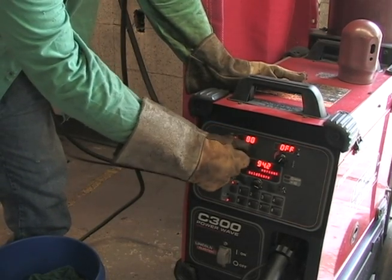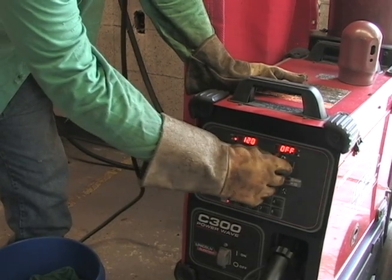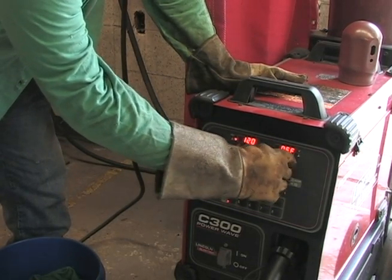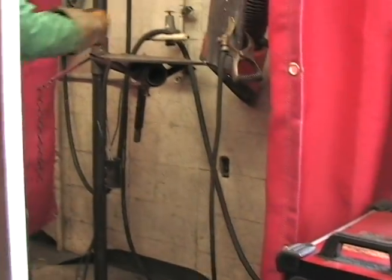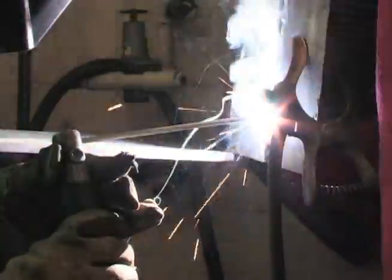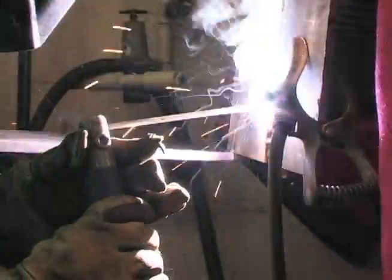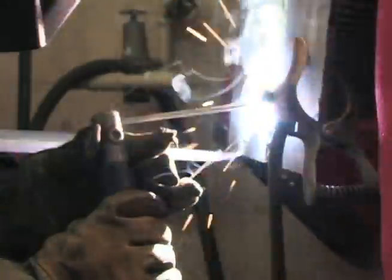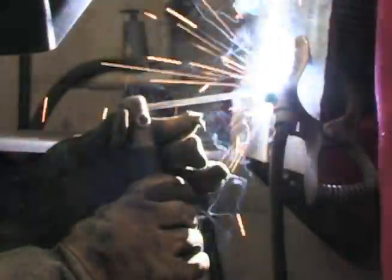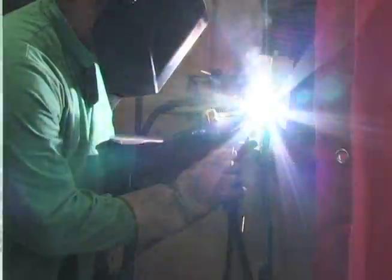For this weld, you need to have between 115 and 120 amps, which he's adjusting his machine for now. Then he has to make sure his machine is on. Now he's ready to weld. Some of what he's trying to control is arc length, rod angle — which is both direction of travel as well as side-to-side angle — and he's also trying to control his travel speed while making this weld. We're looking for uniform ripples on the weld bead face, as well as making sure that it's penetrated and tied in on both sides of the weld bead throughout the length of the weld.